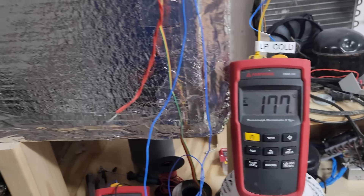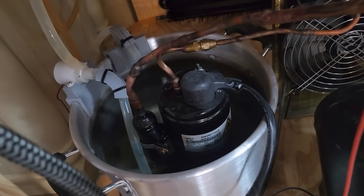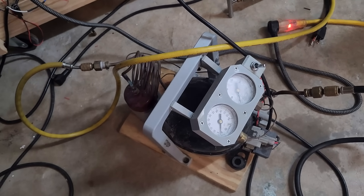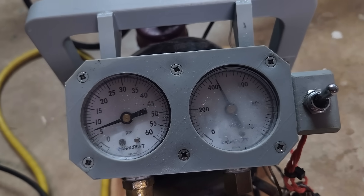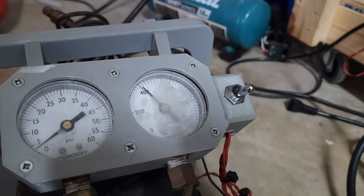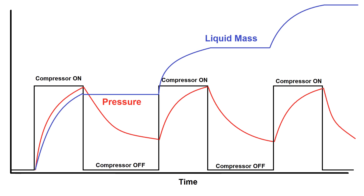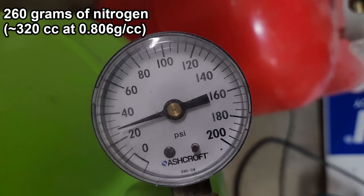After about an hour of run time, I got down to minus 177°C, then went about pumping in nitrogen to liquefy it. I originally set up a rotary compressor in a cooling water bath to feed nitrogen, but it died pretty quickly even though it wasn't overheating — probably an oiling issue. So I switched back to the little fridge compressor I've been using for gas transfer. I take nitrogen from my 10-gallon tank and pump up the cold tank in the cryocooler to about 450 psi, which is right at the critical point for nitrogen. Then I shut off the compressor and let the liquid cool for several minutes until the pressure drops to around 250 psi before pumping again — the compressor runs less than 30% duty cycle. I repeat this until my 10-gallon tank goes from 120 psi to about 30 psi, representing around 260 grams — enough to completely fill the cold tank as liquid.